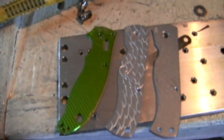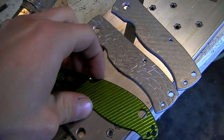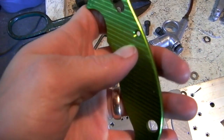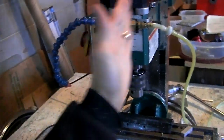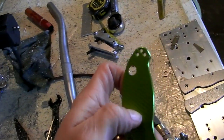One thing that's been bothering me since as long as I've been using it — the purpose of these horizontal and diagonal lines is to surface the material flat, to get it to the exact right thickness that I want. But there's a ridge between every one of those lines that I can catch my fingernail on. That's because if the machine is tilted to the side, front or back, side to side, then the cutter will not be perfectly flat. My machine is quite a bit to the front and a little bit to the side, and that's causing that uneven surface.